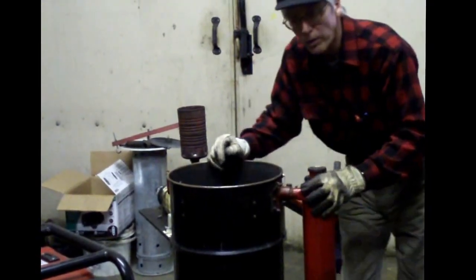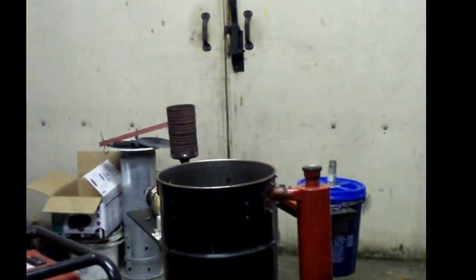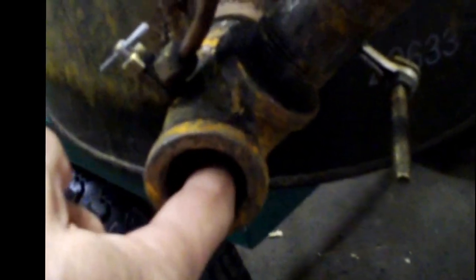Let me show you real quick with the camera what it looks like inside. You see the air inlet here — air comes in right here, sucked into the gasifier. This pipe is the exhaust return for some of the engine exhaust to help cool down the reaction, and this is a valve to control that. This little pipe with the valve is for a fluid drip to add fluid to the hot gases to increase the hydrogen content. Looking inside, you can see the nozzle in there, and right here is the gas outlet that goes into the cyclone to clean out the dust.